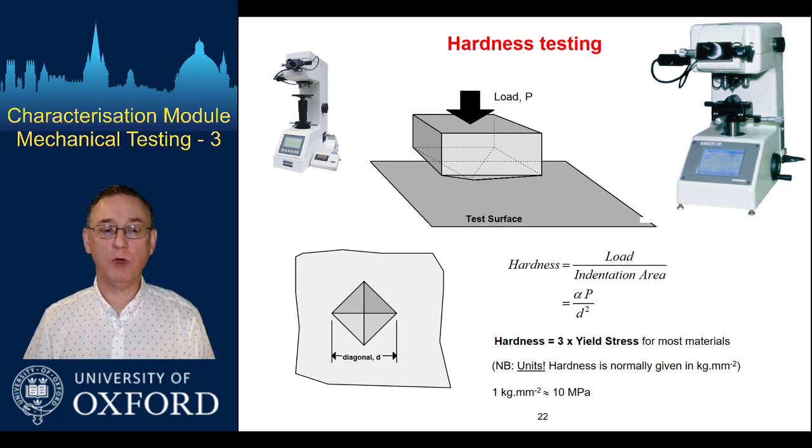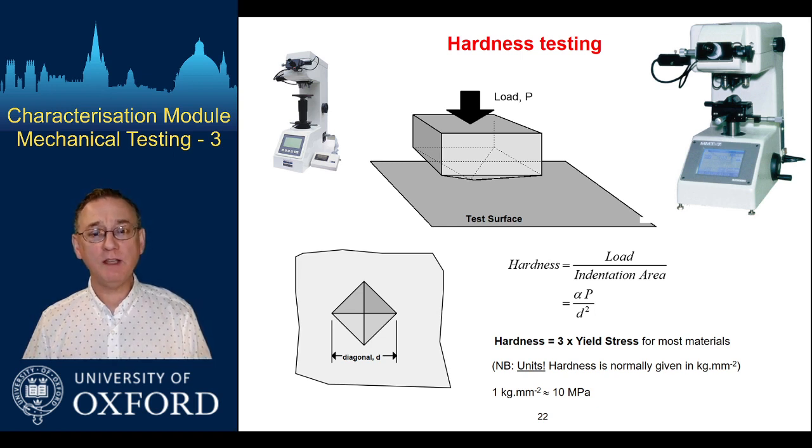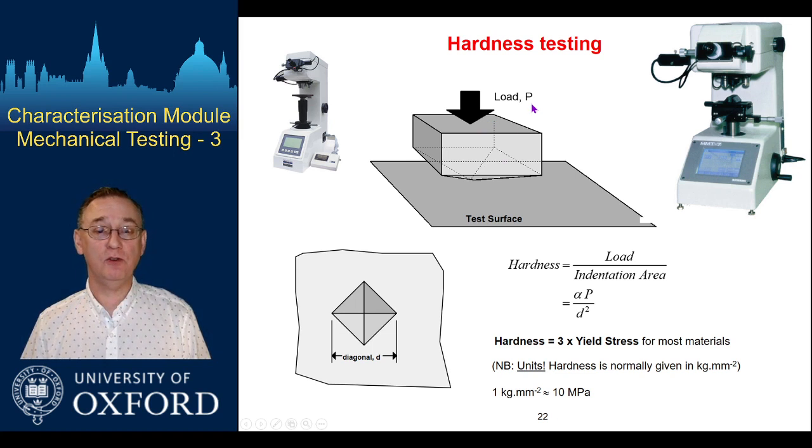Essentially, as foundries were being produced around the globe, many of them came up with different measures of hardness — different ways of measuring hardness that satisfied their own internal quality checks. The idea is that you have a simple flat surface of a sample and something relatively hard and resistant to deformation that you use with a defined load and a defined shape to make an impression in the surface. The combination of the size of the impression and the size of the load gives you a measure of how resistant the material is to deformation.